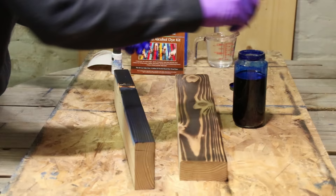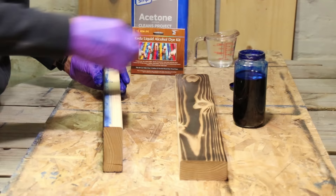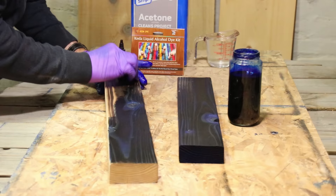It absorbed very nicely and went a little bit darker than I originally intended. If you notice on that board there, it has a little knot. If this were going to be a good piece, I would probably shim that notch up, color some epoxy resin, and pour it in there — I think that would look really cool. But like I said, this is just going to be on a bench. There you can see where I dip my cloth into the dye stain and apply a couple of drops of the concentrate to it.